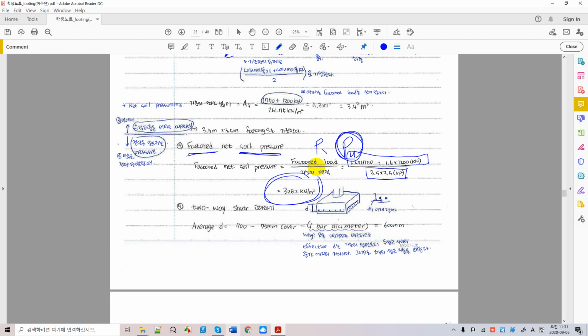All right, and now let's calculate shear. Let's start with two-way shear first. So we assume D as 700 millimeter, and then the effective D, the calculating D, is obtained by subtracting, and this is actually H, isn't it? The pile depth minus the cover and minus the diameter of the bars, something like this, right? These bars there, and we just come up with an approximate effective D, which can be calculated in your design.